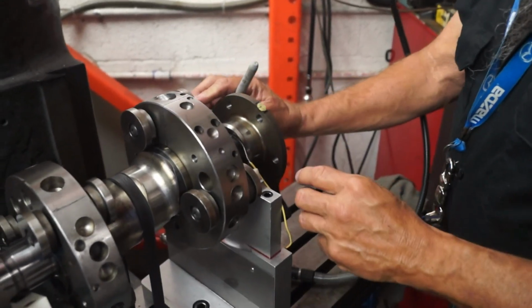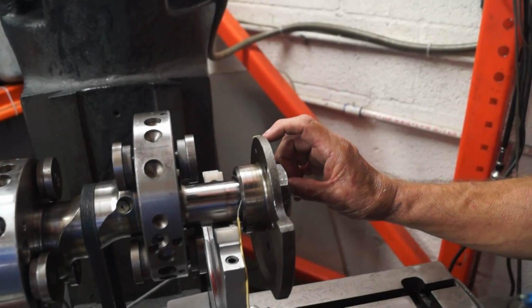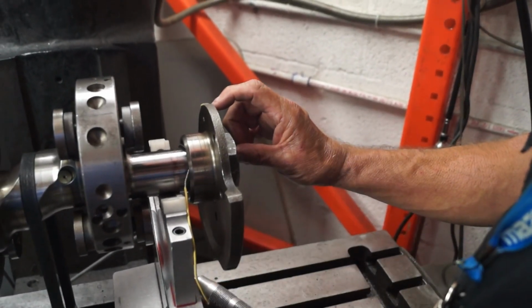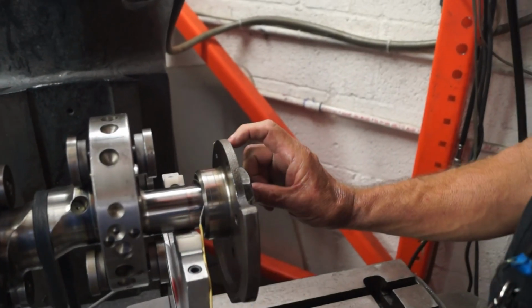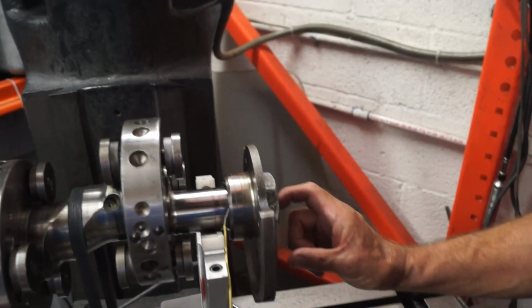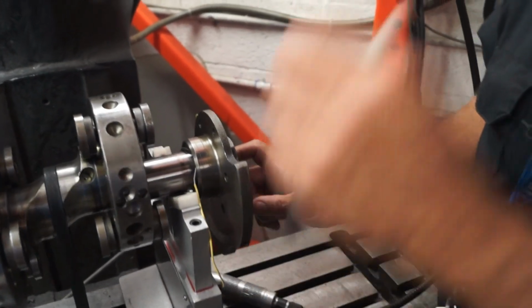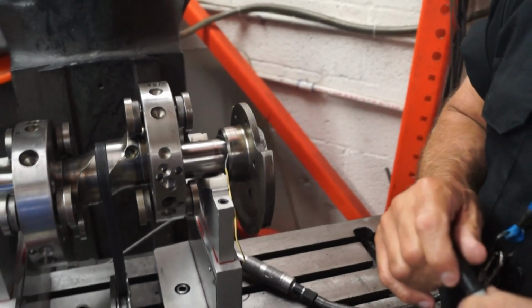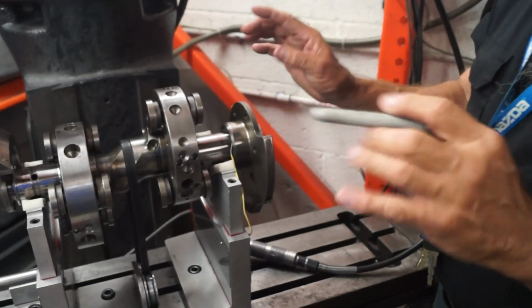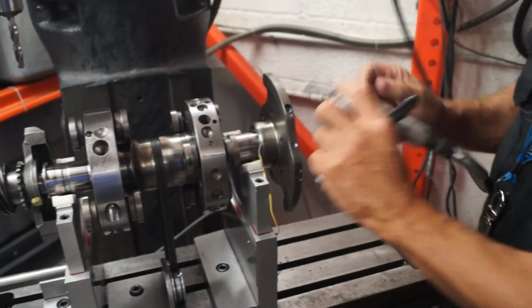Well, it's real simple, because the distance for that 0.4 grams at a radius of this amount has less of an effect, because we're gonna be drilling over here on the operating radius. That amount would be that amount, but now that weight out here actually has greater mass, because you're taking mass times distance. So you'd have to take less than 0.4 grams, like 0.2 grams or something like that. Exactly. You know, basically what I have to do is just opposite to that, just kiss it with this and spin it again.